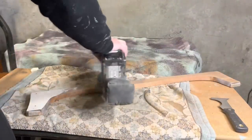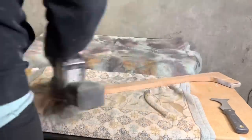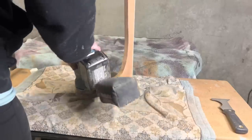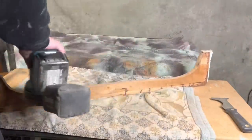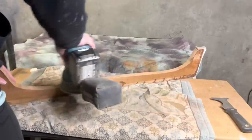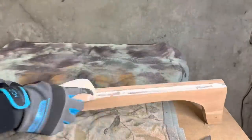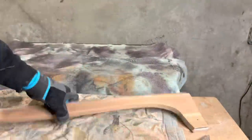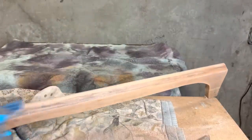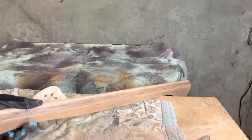This paint came off really easily just because it was spray paint and there was probably no prep work done beforehand, which always makes my life so much easier. So I did a lot of sanding with a power sander, then a lot of hand sanding, and then I remembered I have my amazing scrapers, so I used those too — all of it worked well. It just took a long time because I knew I was going to keep quite a bit of this wood. It was a very interesting piece because there were at least three different species of wood — I counted mahogany, poplar, and maple. There may have been a couple others, but I was like, wow, that is a lot of different kinds of wood.